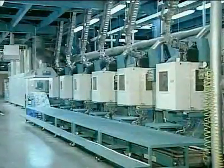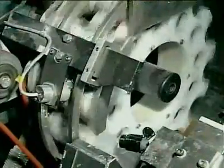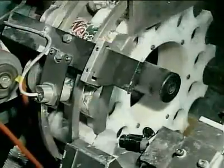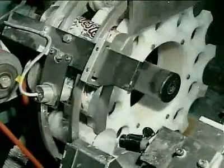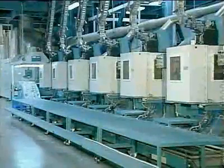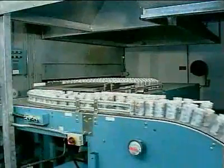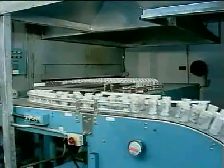Next, the cans are passed on to spray machines to be sprayed internally with a coat of lacquer. The cans are rotated in a vacuum turret to make sure the inside surface is fully and evenly coated. The lacquer provides an effective barrier between the can and its contents. If left uncoated, the result could be an off taste or even corrosion. An internal bake oven dries the internal lacquer.